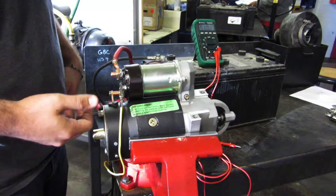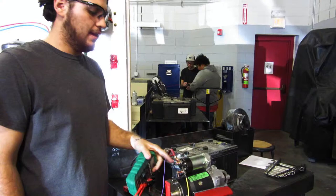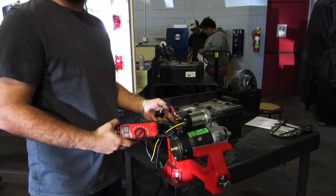The first thing is to see if the motor is working properly. Then you use your meter in a series of tests to determine whether the control circuit — what controls the motor — is working properly. Basically you use the amp meter to see how many amps are drawing across that circuit.